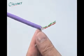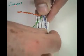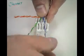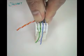Place the cable against the connector so that the end of the jacket is in line with one of the terminal blocks. Then, paying attention to the color-coded label, start lacing the first two conductor pairs into the correct wiring positions in the opposite block. Try to retain the pair twists as close as possible to the terminals.